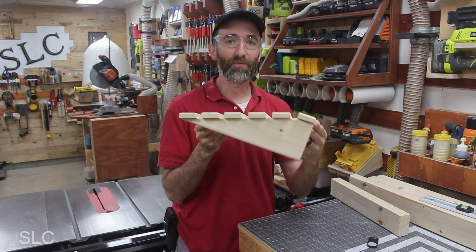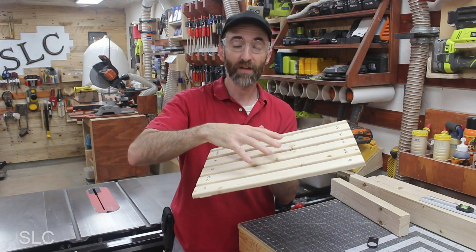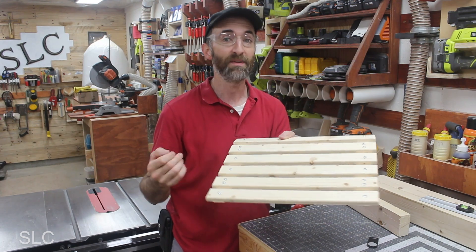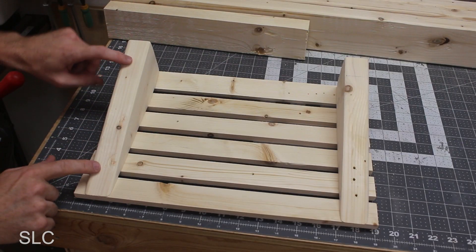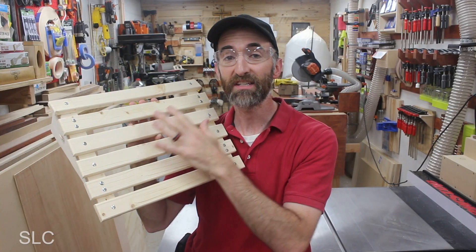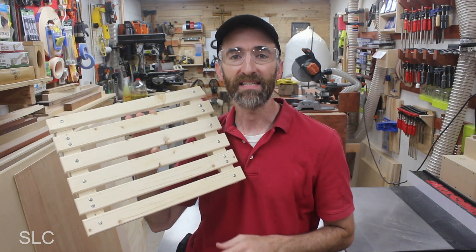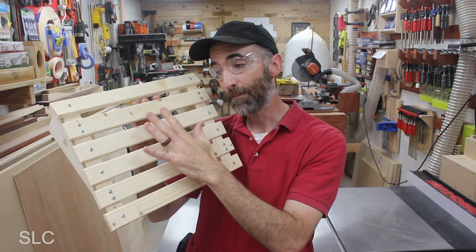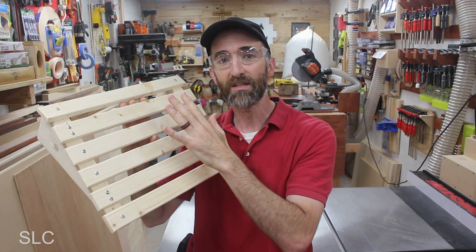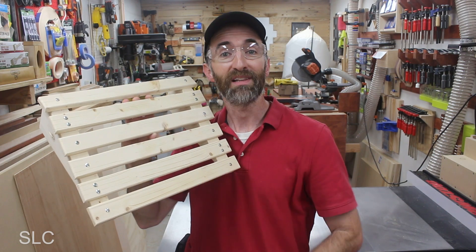And there you have it — a great little footrest, whether it's for your desk or your couch. Keep in mind this is not to stand on; you could easily break the strips, but having screws means you can replace them if that happens. You can always add some rubber feet to the bottom corners to keep it from moving around. Since this is made out of wood you can easily stain it to match your other furniture. And of course you'll need some kind of top coat — whether it's polyurethane or similar — with several layers so it doesn't discolor from the oils from your feet or water from your shoes. Protect it so it can last a long time.